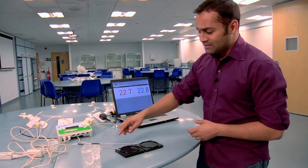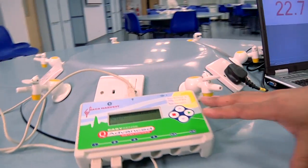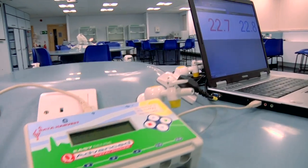If they're not convinced that they are indeed at the same temperature, you can use a setup like this. I've got a couple of thermocouples attached to each block going through a data logger, so you can see they're at more or less the same temperature.